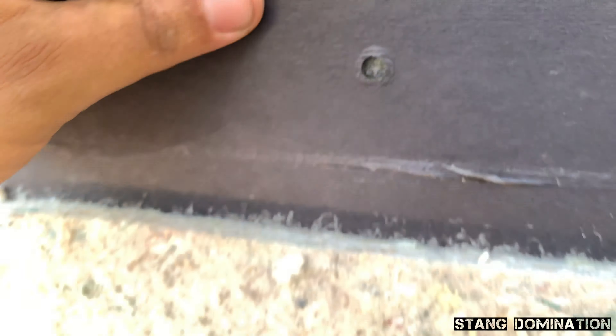Check this out — on the other side, if you try to pull, the carpet is so cheap it actually pulls with it. You gotta rock it back and forth in order to cut it, because if you just pull it and drag the razor like you usually do, you'll just rip the carpet open and ruin it. See, it's already messing up right here — you gotta chop it, slice it just like that.